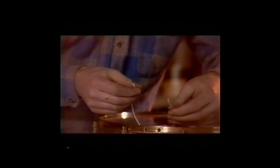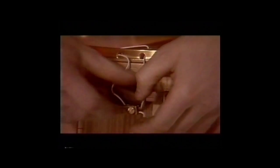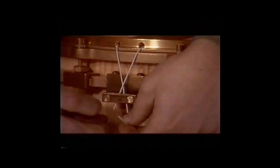Finishing represents the final process in manufacturing shells. Shell color and various types of wax polishing are chosen at this stage. At Soprano, we choose to preserve the genuine beauty of the wood grain with a natural aniline covering, obtaining a beautiful veneer. With beeswax polishing, the drum is almost complete. The opacity of the wood combines with the luster of the wax finish, creating the characteristic look of beautifully crafted instruments, similar in appearance to those made by the great Italian lute makers.